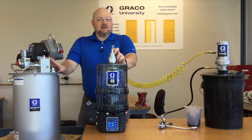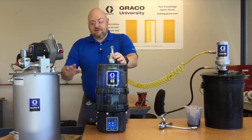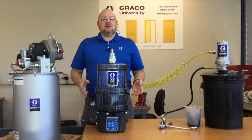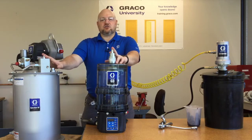So if you have a vent line coming from, say, a remote fill manifold, then the vent line would hook to the bottom, but the fill line needs to hook to the top to come in through the autofill shutoff valve. Hopefully this video has provided a good explanation of what's going on inside of the autofill shutoff valve.